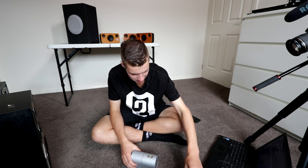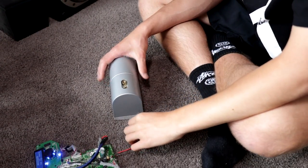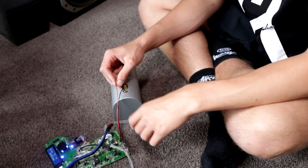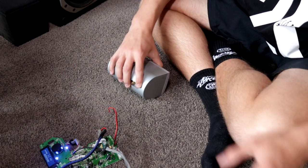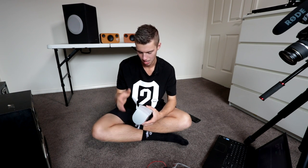Let's listen to them before pulling them apart. I'm not sure how I'm going to hook the Doze one up — I've got my little Kicker amp here that I've used in plenty of previous videos. I'm going to stick the black wire in the middle terminal and touch the red wire to the side. And it sounds absolutely terrible. We have two two-inch full-range drivers providing very little treble, and the bass sounds a little muddy and boomy. We'll have a look inside and see if they actually have nice size magnets or if there's just added weight, which is what I'd expect from knockoff Bose speakers.